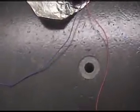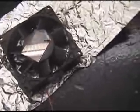Then, I used a piece of double-sided tape to attach the indium-tin oxide glass conductive side up to a fan. Using a cotton applicator, I applied a layer of the ruthenium complex film on the center of the glass, making sure that I allowed for some uncoated space near the edges.